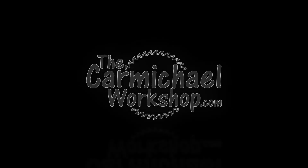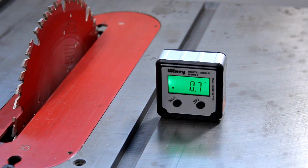Today I'm going to make a birdhouse that looks like a Rubik's Cube. I'm making this birdhouse out of a regular 6-foot pine 1x10. And to get started, I'm going to tilt the blade on my table saw to 45 degrees and then cut 6 9-inch squares that have bevels on all 4 sides.